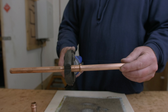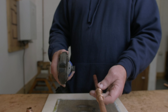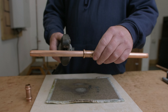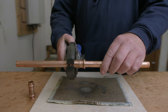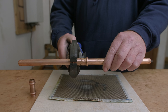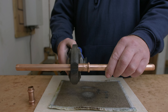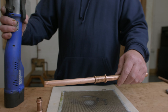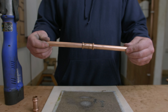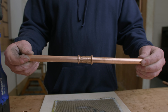Once it's done I can release the jaw, release the fitting, turn it round, put the fitting back into the jaw again and operate it exactly the same as I've just done. Again once it's finished, I'm just going to make sure it is securely fitted. The fitting looks as though it's been pressed.